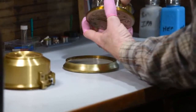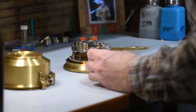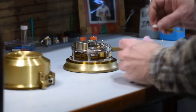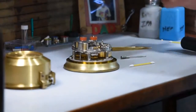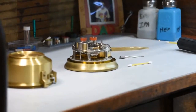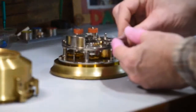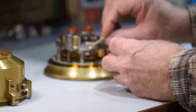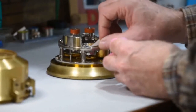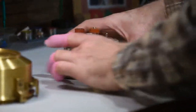If you don't have the balance brake when your chronometer is running, you use something soft and gently stop it. Then you make a wedge — I like this waxy paper material — to act like a spring. You put the open end underneath the balance, between the balance and the plate. Now the balance can't rotate.